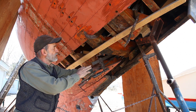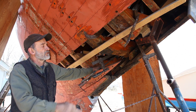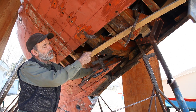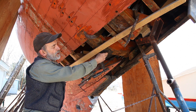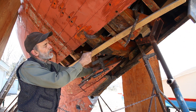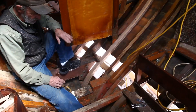It's got a major frame, then it's got three minor frames that are bent, and the major frames are sawn. Some of the major frames are in bad shape at the bottoms where they were bolted to the floor timbers with iron bolts and steel. That's all deteriorated and some of the ends of the frames are bad, so we're going to take this frame out completely, all the way to the top, and replace it with a laminated frame.